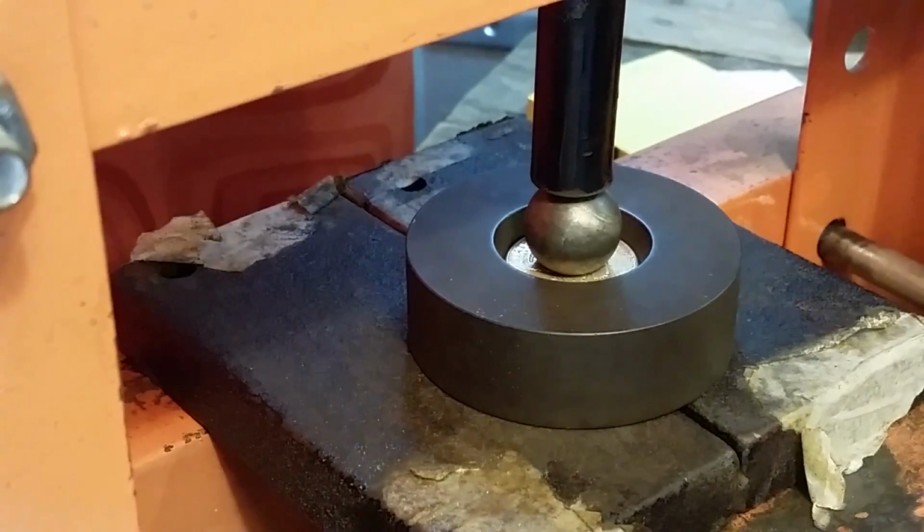Also, I never mentioned this before, but if you have your ring stretcher reducer, your ring sizer, and your dies will fit underneath it, like these, you have to get these made, you can go ahead and use that to press too, with half dollars and quarters. You don't have to get a bigger press. It makes things easier though, it really does. But you can get away with using the regular stretcher reducer, if you can fit your dies under there.